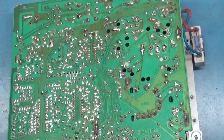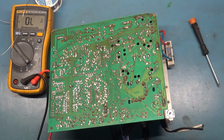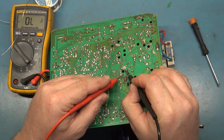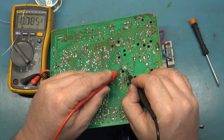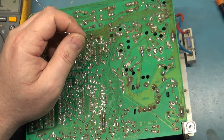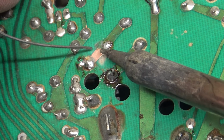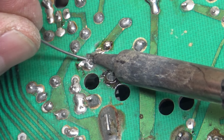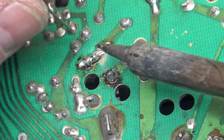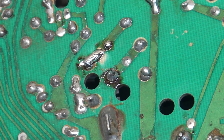And so you can see here with me. Alright. Diode mode, we should get a 0.45 voltage drop or so. Negative lead on collector, and then positive to, I believe, the base and the emitter. Okay, HOT is fine. So let's solder this in here. There we go. Not trying to win any awards, but I think that'll work.